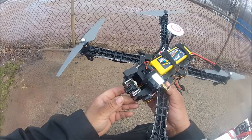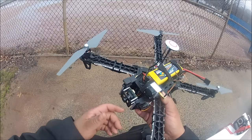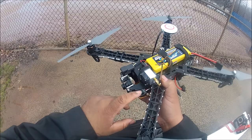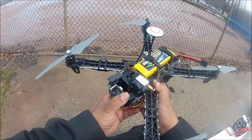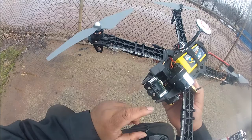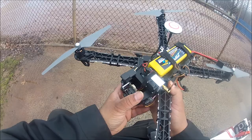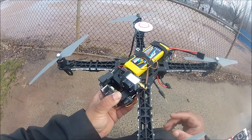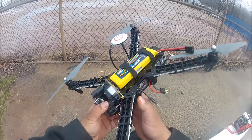I live in the US, and here we operate with NTSC, but one thing I didn't like about this quad is it came with a PAL camera, and there's no manual to switch it to NTSC. So if you want to use more than one camera on this aircraft, make sure the other cameras you add are also PAL, because the camera switch is connected to the OSD, and when you switch to a camera in a different format it confuses the OSD. So make sure all your cameras are PAL.